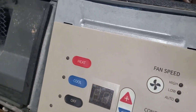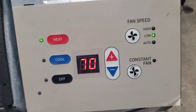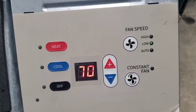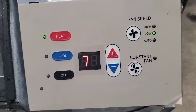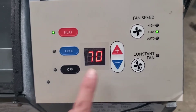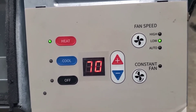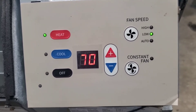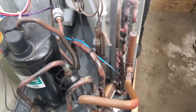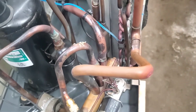There are still two important things you need to know. Number one: the heat pump is going to work within four degrees of the set point. Anything lower than that and it's going to run on the heater coils. For example, if your room is at 50 degrees and your heat is set to 70, the heater coil will run until it reaches 66 degrees and then it will automatically activate the heat pump.